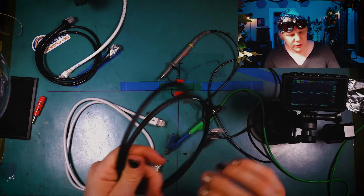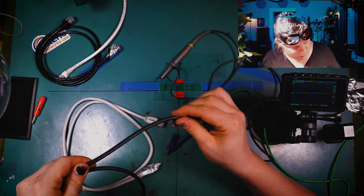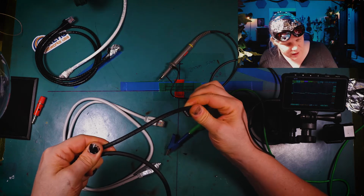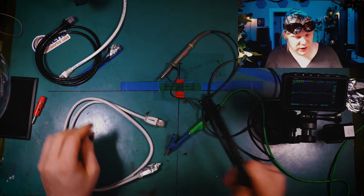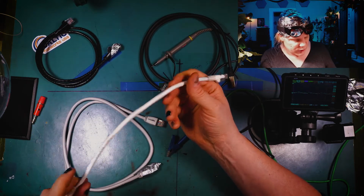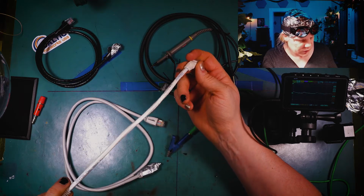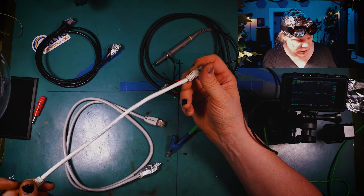And this cable here will say what bandwidth it'll do. So this will do 40GBASE-T, Cat8, 2,000 megahertz is what it's capable of handling. I think Cat6 is only good for 350 megahertz. And that's the channel width of the comms channel between the transceivers.